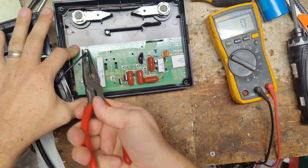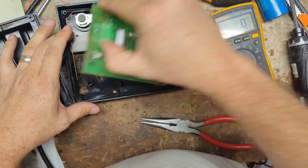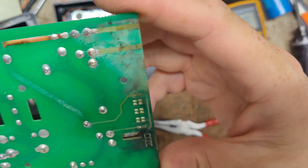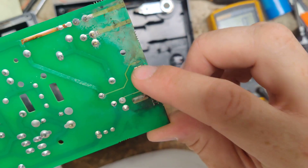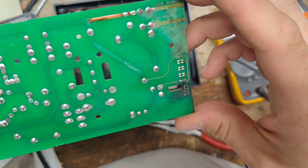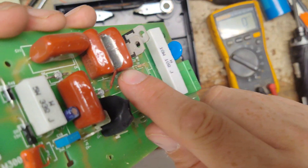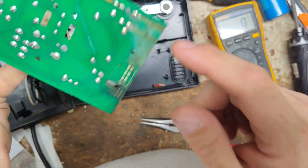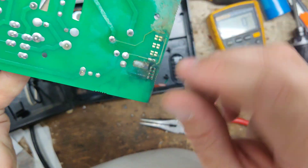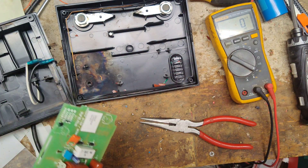This tab right here, where that plugged into the transformer, is burnt up. Hopefully we'll just be able to do some cleaning; we can always replace it if we have to. Yeah, this board is shot — see that board's all burnt up. Lightning is like an AC power surge — it got this one. Blew the capacitor up. When I flipped it over, all these little resistors are blown. Yeah, this board's no good.